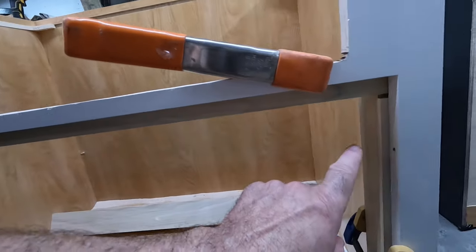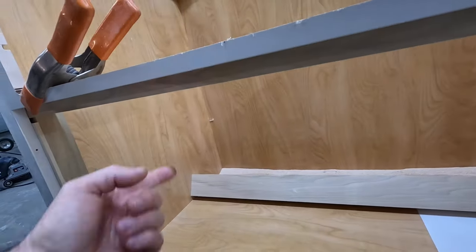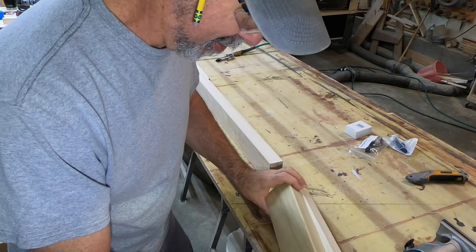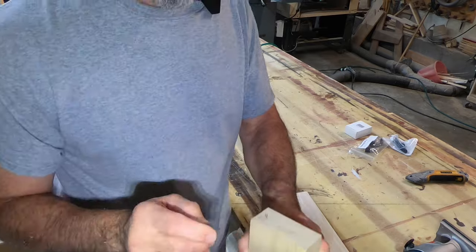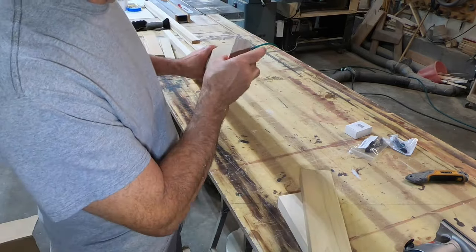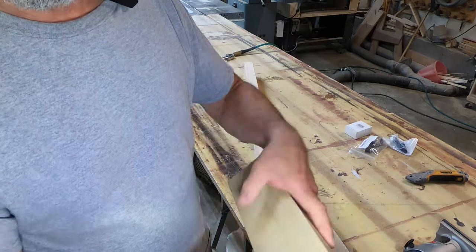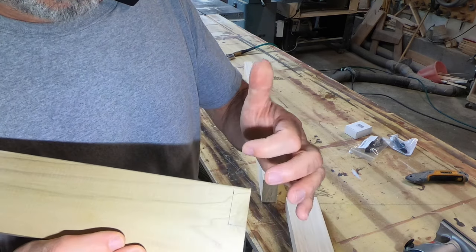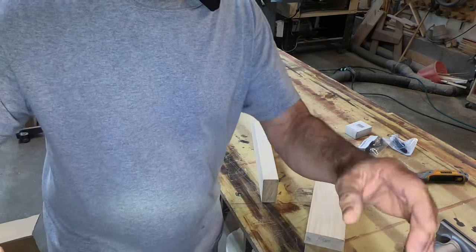What I'm going to do right now is take out this piece, this piece, and this piece — which are not mounted, they're just clamped on. I'm going to route the edges so that there are no sharp edges. Well, I guess the camera wasn't running — you didn't miss much. All I did was route whatever needed to be routed and I marked everything with an arrow so I'd know which edges needed to be routed. Now we're going to go over to the table saw because the next step is to notch this out. I've only marked one because we'll make this cut and do it on both of them, then set up and do the second cut on both.